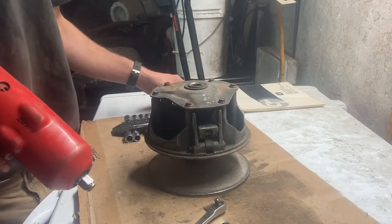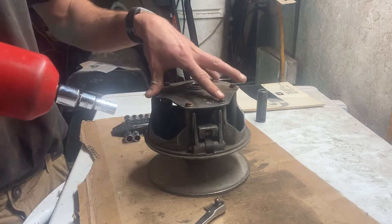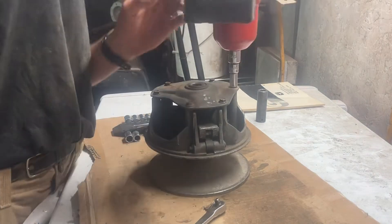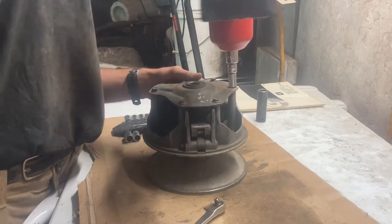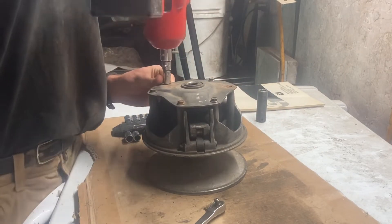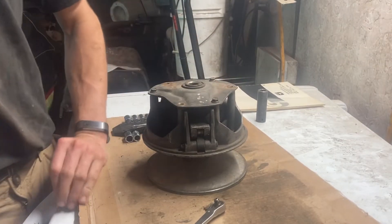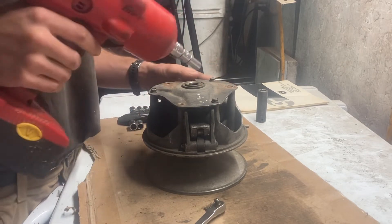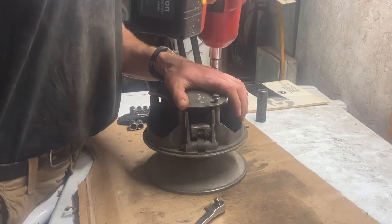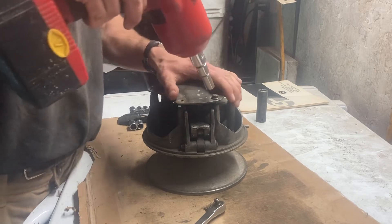To take it apart, you take these six bolts off on the top. When you do that, you want to do one on each set of towers and then slowly work in a circle to get the others off, because this is under spring tension and it's going to want to pop up. So the first three don't really matter, but generally I like to keep them pressed down. You can see it's popping up a little bit — still pressing down.